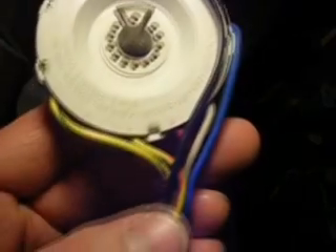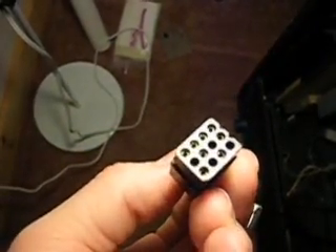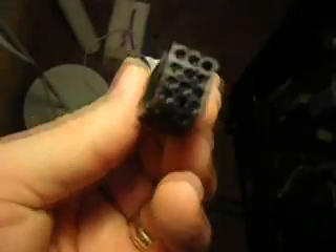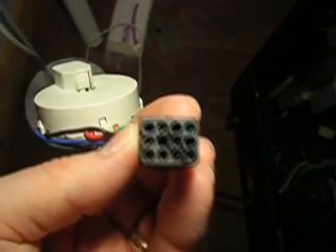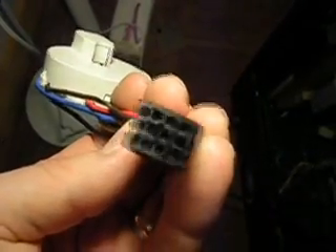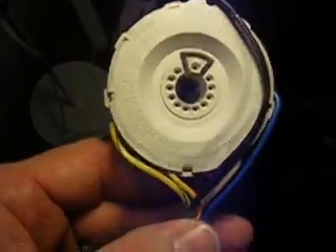It still has eight wires going into the adapter that all come down to where it plugs onto the wire from the CRT rejuvenator. There are only eight connectors in this connection here, and there are eight wires. I didn't know why there would be wires that had been clipped, but maybe they're not used. After getting online and doing some research, I found two charts showing the pinout for the connector on the 23, numbered 1 through 12, showing all connections used and not used. So hopefully that's legit.